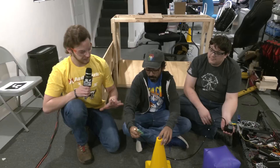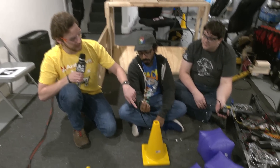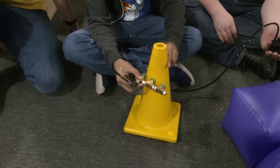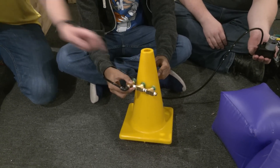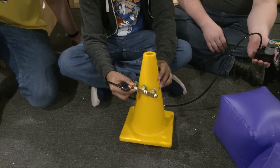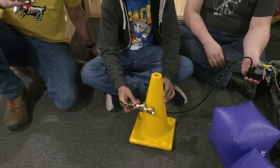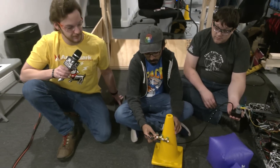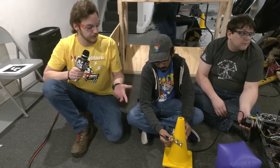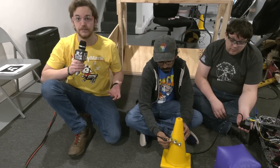One consideration we did have for this is that, as you can see, this is powered from a single vacuum pump on a single line. That means that if one suction cup doesn't engage, the whole vacuum will be lost. So you can't just drive up and do this. But if you had a separate vacuum pump for each suction cup, then you would be able to use any of the three and you wouldn't need to use the curvature method. Or you could grab it with two if that is advantageous. So just something to consider if the extra pump infrastructure is something your team can handle.